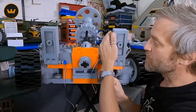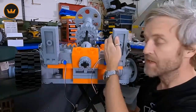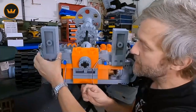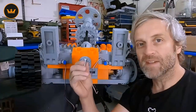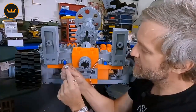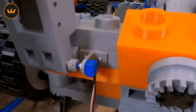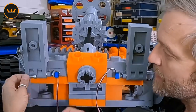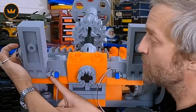I've added potentiometers to both the brake and the accelerator pedal. The reason is that when I'm accelerating I don't want to be pressing the brake and trying to drive the motor at the same time, so the potentiometer on the brake will actually turn off acceleration and also apply electrical braking. The hinge piece here in the Lego has an M8 cap bolt going through it. I've printed a small part that goes into the end of the socket head with a grub screw — the grub screws down onto the potentiometer — and then this simple bracket just so happens to rotate with the pedal as it moves, which in turn rotates the potentiometer.